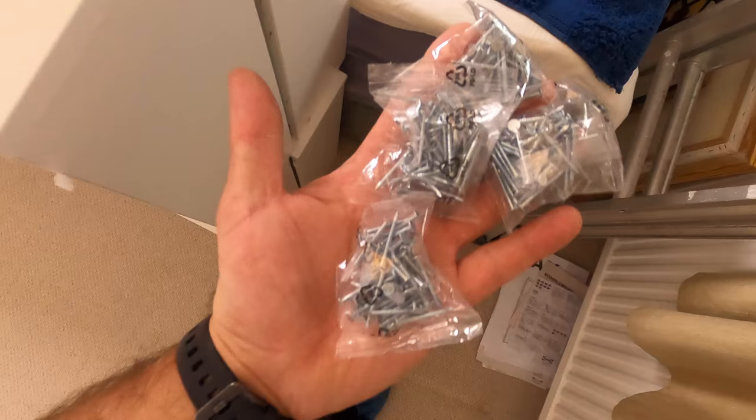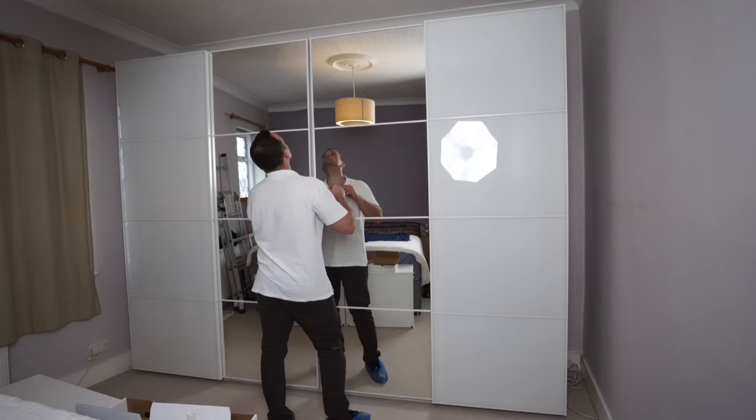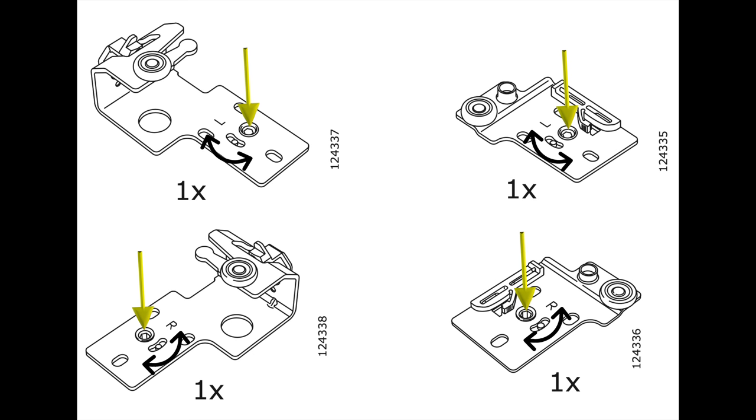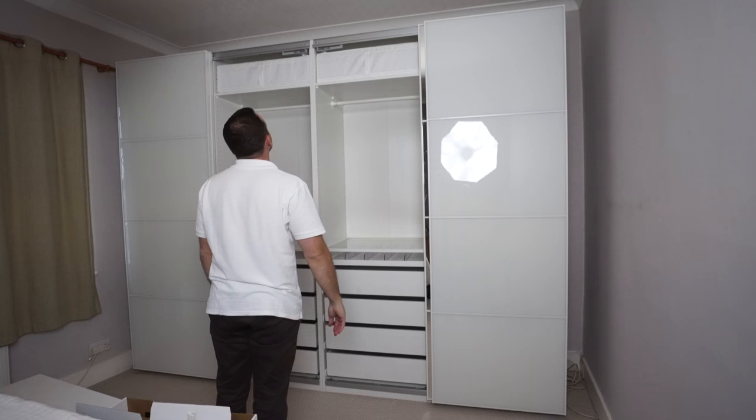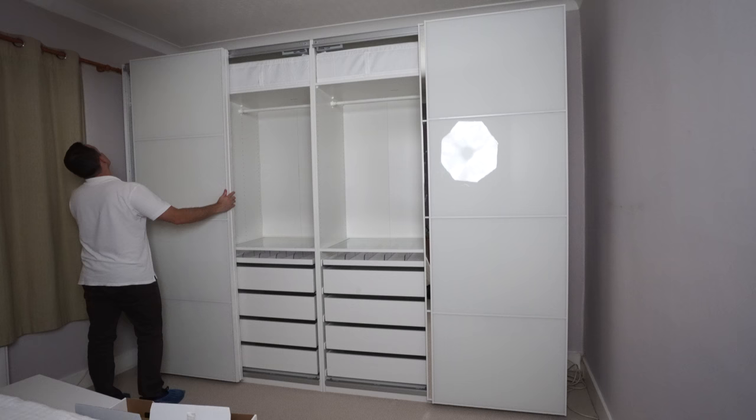You see the bubbles at the back because they didn't put the nails in. I doubt the frames are done correctly either — there are a few gaps between the panels. There is a slight adjustment on the hinges: you can twist the door left or right. Just put a long key on the middle and you can twist the door left or right. This is just a slight adjustment and I don't use it that often — I prefer the method I'm going to show you in a moment.